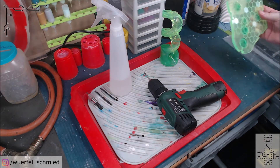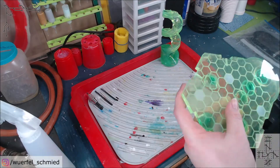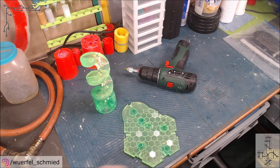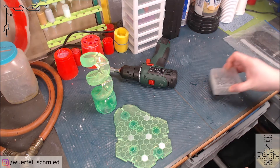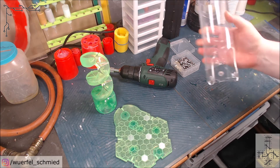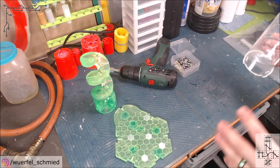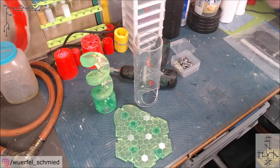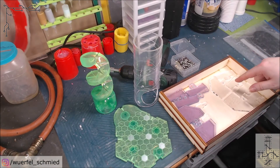So time for the final assembly. We have our cleaned-up, tapped, and ready-to-go resin parts. We have the needed bit in our drill, some screws, and some plexiglass — the tube, fresh from the laser. You can see I also tapped these holes — the holes were already pre-cut in the material with the laser, so I just used the cordless drill with a tapping bit and a countersunk bit and then added the countersunks.